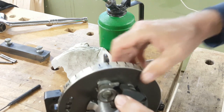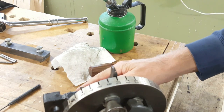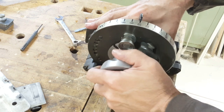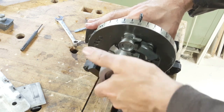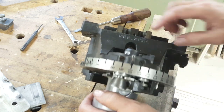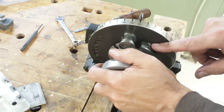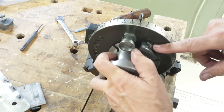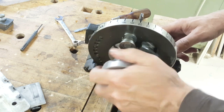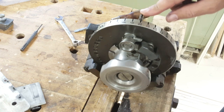There's also no good way of oiling this when it's all assembled — there's no oil hole in this handle — and this knob turning on this shaft to do that camming action was one of the bits that was all seized up, which prompted me to take this apart in the first place. I think I need a bit of oil here because this should snap back on its own. I've now lubricated the spring so it actually causes this to return like it should. I had not lubricated behind the cam here, so I put some oil where this hook hooks onto the end of the locking pin. Now everything seems to work fairly nicely. The astute amongst you will realize that I put this pointer on backwards the first time — I've reversed it now.